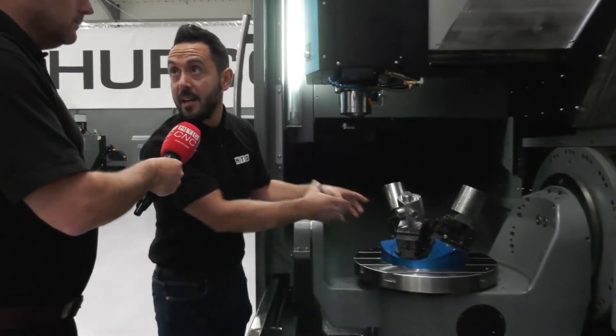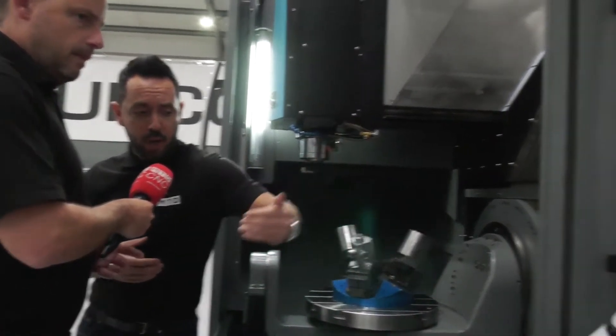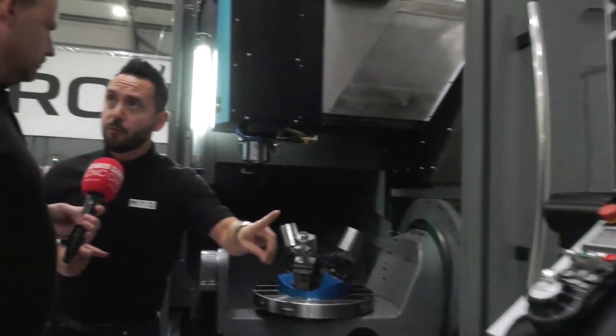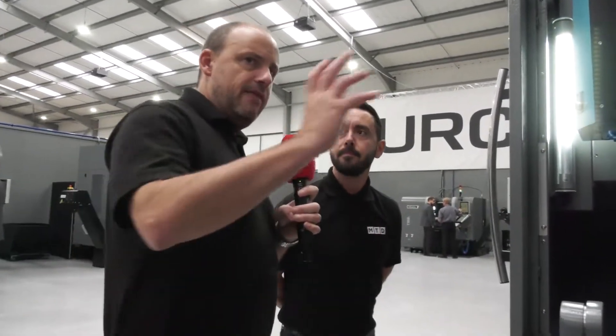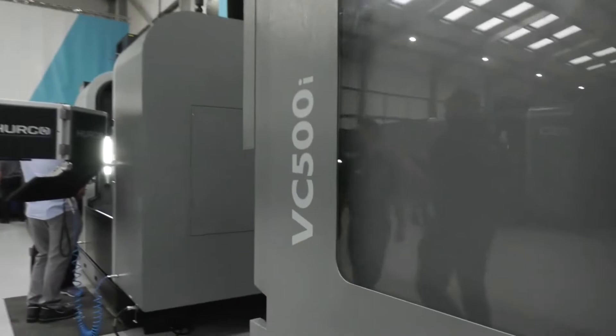One extremely important point: for a lot of one-off work, the accessibility is brilliant for setting — for the operator being able to set the part and be involved with the machine. The actual control also turns around with the machine. We can't forget to mention Hurco's own software which simplifies the programming of 5-axis parts. Effectively you send it the model and it will write the program, calculating each 5-axis face and depth. It totally simplifies it so you don't need a CAD/CAM package — you can program directly into this control, which is priceless for some end users. That's the MAX5 control — a double-screen touchscreen system.